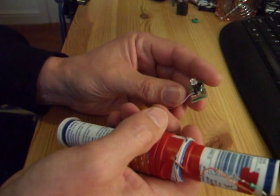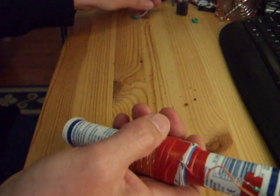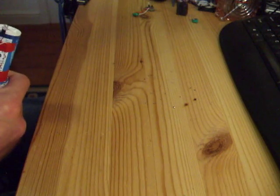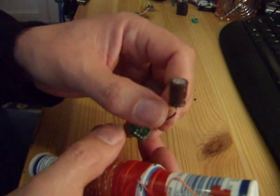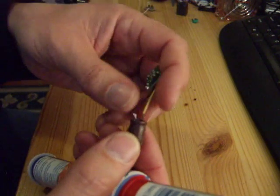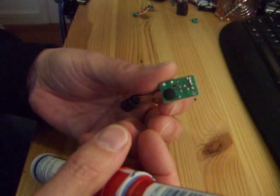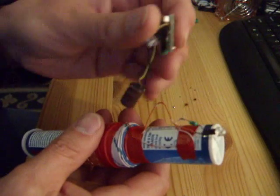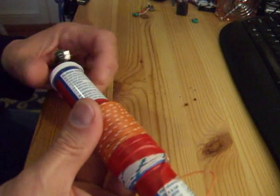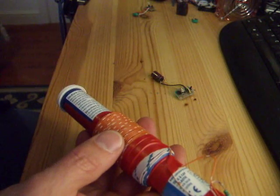I had a little think about that and thought you might not believe what I'm doing if I leave a battery on there — you might think it's just being powered by the battery. So I've taken the battery off, and this is a little capacitor that I've salvaged out of something. What I'm going to do is wire that in place instead of this LED, so that hopefully the capacitor takes a bit of charge as we move it, and then discharges through the LED and gives us a brighter light.